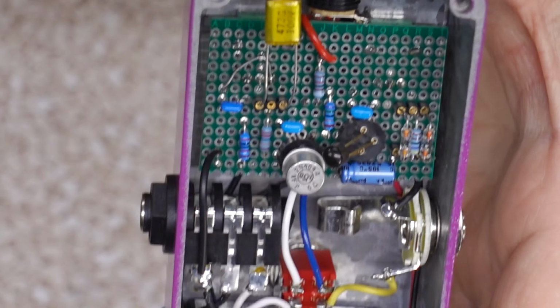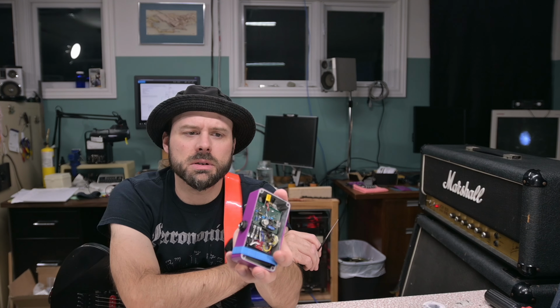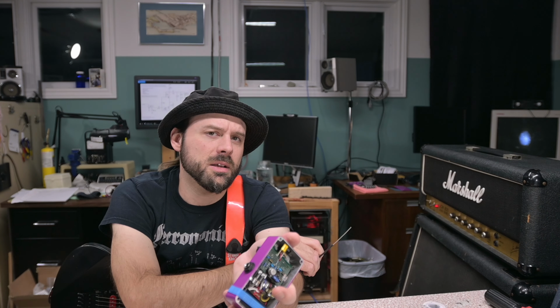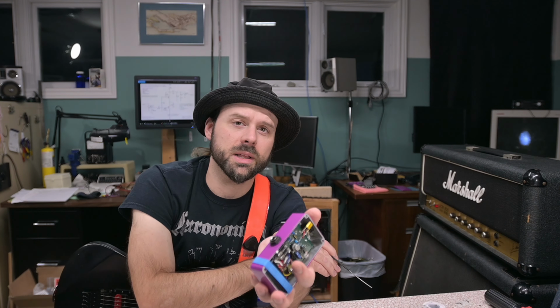Those are MLCCs with a C0G/NP0 type dielectric, which are very stable. And actually, as far as capacitors go, to my testing and even to my ears, they're good quality capacitors. I've used them in some audio applications and they sound great. I would almost want to use them over a cheap polyester film. And of course, a quality capacitor comes with a price tag. You're not exactly going to be breaking the bank building a one-off pedal for yourself, but I can see why a corporation might not want to use the more expensive ceramics over a cheap polyester film.